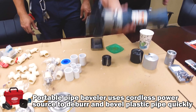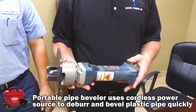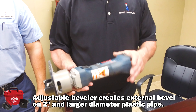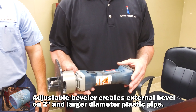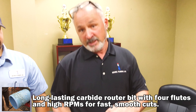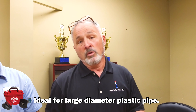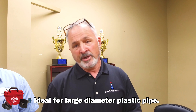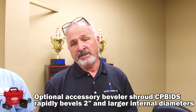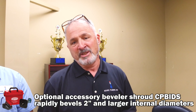This tool will be for larger diameter pipe from 4 inch up to 15 inch pipe. We're not going to do it right here because of the shavings and everything and the noise, but it does a larger bevel so you can push the joints together and get a good proper glue joint. Or, in some instances in PVC on drainage, it's so you can push the gasket fittings together. And if you don't bevel it, then you'll never get the pipe and fittings to push together on drainage.